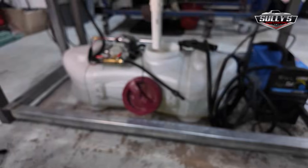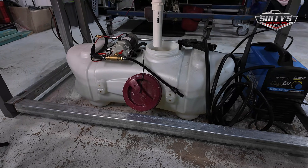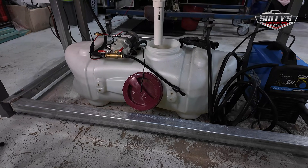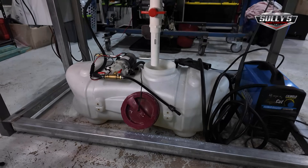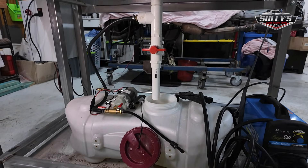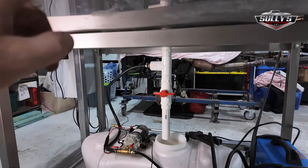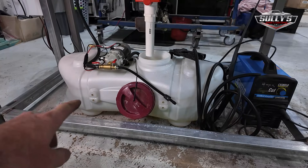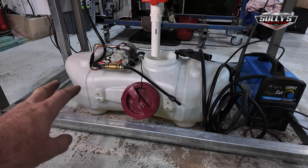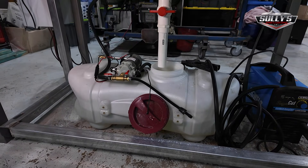That particular pump and tank assembly is one out of a weed sprayer tank that goes on the front of a quad bike or back of a tractor or loader on a property. I filled the pan first, knew the level — I was probably 10 or 15 mil down from the top — and from there I knew the volume and I have the tank marked for the fill volume. It's just coolant out of a car, a watered-down mix, because I don't want all the fingers on the pan rusting up. It seems to be working pretty good — it's probably a quarter full already.